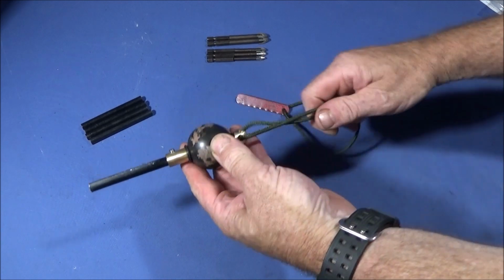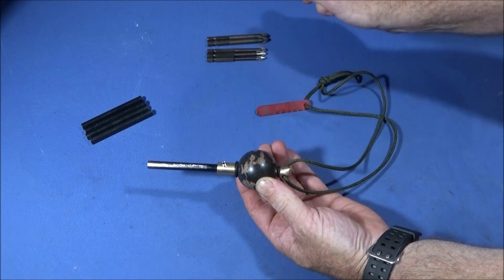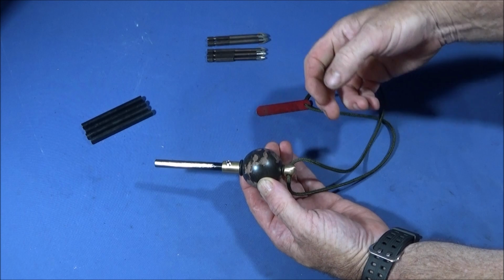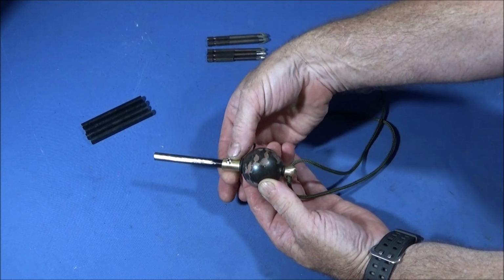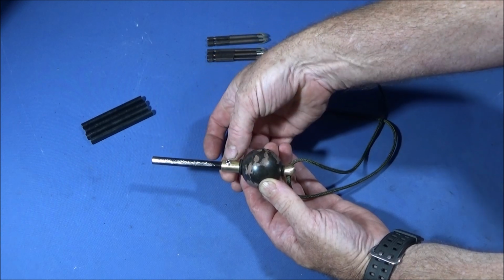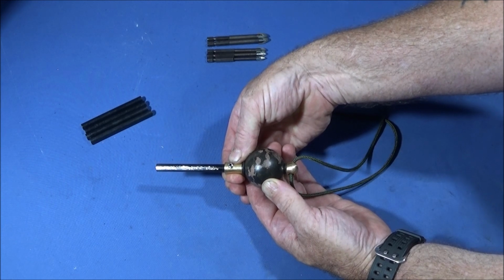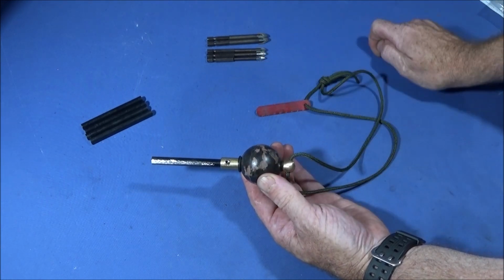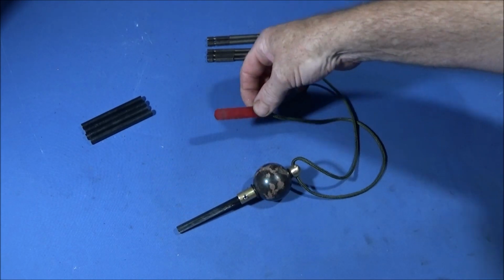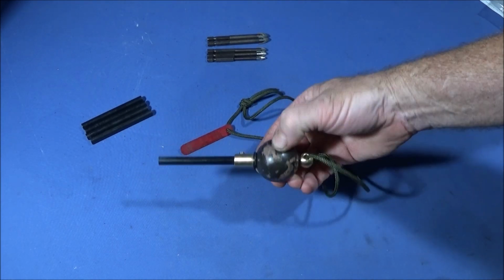And when you're drilling the marble spheres, make sure that you don't drill right the way through. I did that with the first one and it actually broke the end off when it went through. You have to actually make this end up here first, drill down to a certain depth, and like I say, glue this one in with the Loctite 638, put it in the jaws round the other way, and drill this end here and make the other part up. So you learn by your mistakes, and I've got 1 out of the 2, but I'm very pleased with that.